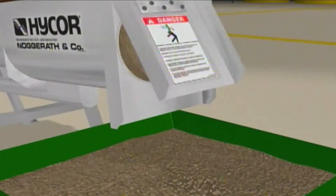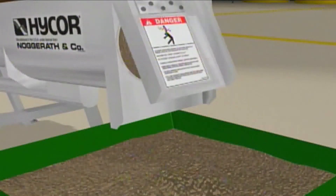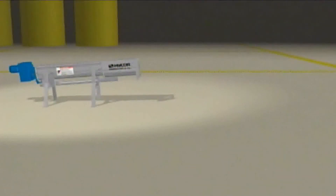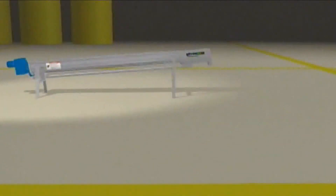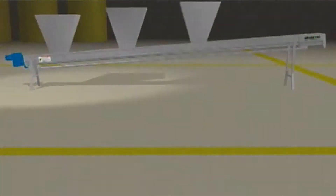As the pressure builds, the door opens and a compact plug of solids is discharged. The Helix Press offers flexibility in design — it can convey solids up to 30 feet and can be fed at multiple entry points.